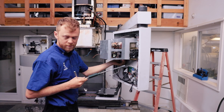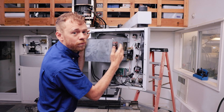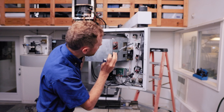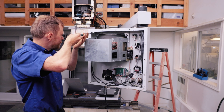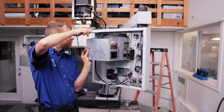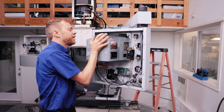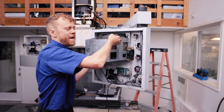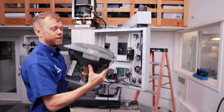The screws on the side hold the sheet metal bracketry, so don't unscrew those — you can't really reach them with a short socket anyway. There are only four on the top and four on the bottom. I've got the last top one in, and I'm going to just push this up. You can see the bottom's free. I'll pull this last nut and keep my fingers out of the insides of it. This will slide right out. The bezel may or may not come with it — you kind of have to shoehorn it out. There's the old screen.